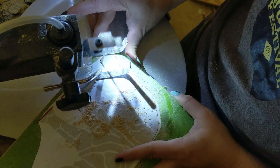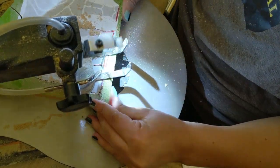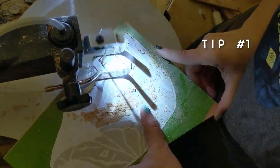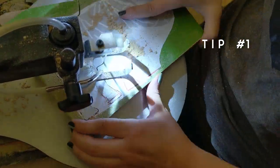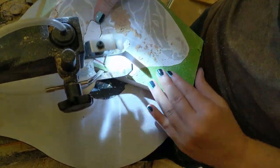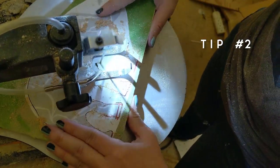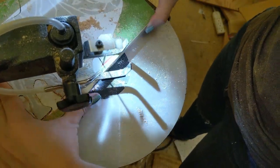This was probably my third or fourth project on a scroll saw, so I consider this a good beginner project. If you're new to scroll saw work, a few tips. Number one: try to cut in one long continuous cut as much as you can. This creates fewer jagged edges that you'll have to sand out later. It can feel tricky when cutting around sharp corners, so tip number two is to go slow. I use a variable speed scroll saw so that I can slow it down when things get a little too quick for comfort.